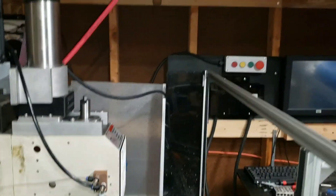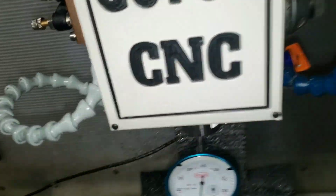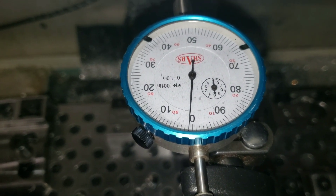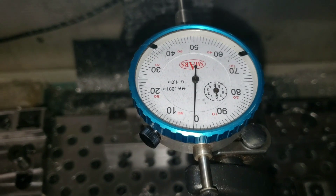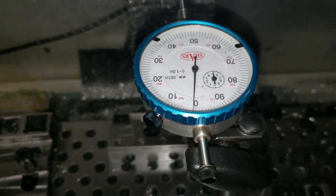I actually then installed my head spacer on here. The next video is going to show the results of installing this column brace and my opinion on whether or not it was worth it. Spoiler: yes, rigidity improved, chatter reduced, and side-to-side flex went away — but it still had some nod. We're going to cover that in the next video and show what I'm doing about that, so stay tuned. Thanks.